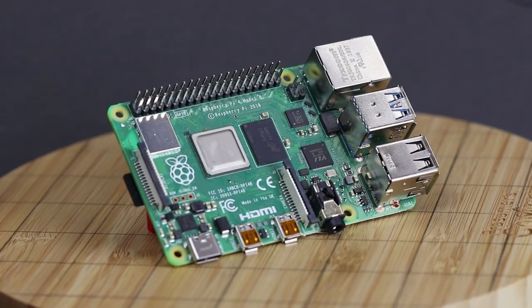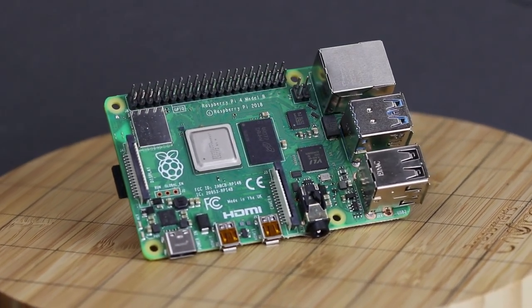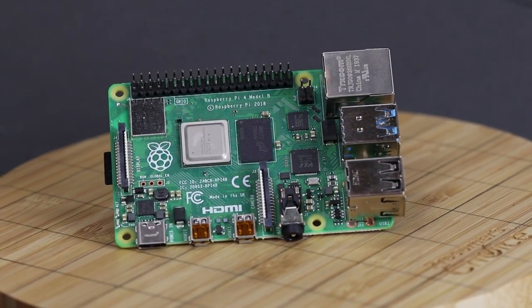Running this whole project is going to be a Raspberry Pi 4 with a 128GB SD card. The way Kiwix works is that it wants to have all the data on the SD card itself. Wikipedia is 80GB alone, and there's a bunch of other stuff I want to get on there. They don't really have native support for putting data on an external drive, but I figured out a way to do it. If we need more space, I've got some USB drives we can use.